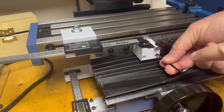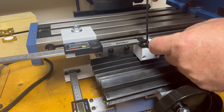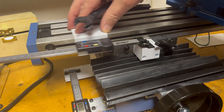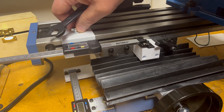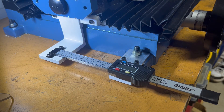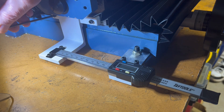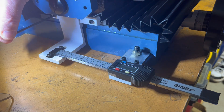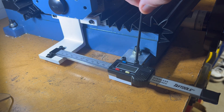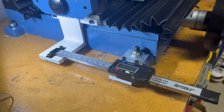This shows how the components get mounted for the x-axis. The block goes in using two existing four millimeter screw holes in the base of the mill, and the DRO attaches to the top of that. There's a bolt-on connection to the actual mill bed so it can move around, letting me set where the six inches of DRO movement starts from. For the y-direction, the glued-together piece goes down one end of the DRO with two bolts into existing four millimeter screw holes in the base. The end of the DRO attaches to that piece, and the DRO head attaches to an aluminum plate connected to the base.